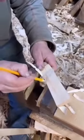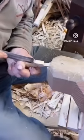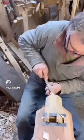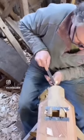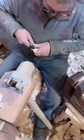The next part in this series on making a fan bird is to mark out the bird's body. I made this beautiful little frame saw out of ash using parts of a coping saw, and I use skip tooth blades to cut the wood with. The skip tooth blades work especially well on green wood. I've also handled this little palm chisel — it's a straight chisel that I've ground in a particular way and I use it for carving the bird's body, mainly wasting wood, before I pick up my Mora 120 and continue carving.